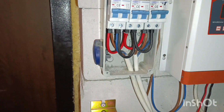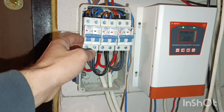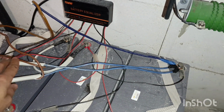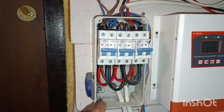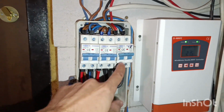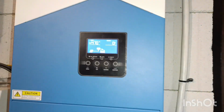I had to remodel this thing. This all now works for a 48 volt system. I replaced the cables. I made them two in parallel, because previously it was only one. So right now I have 20 square millimeters, and they are decisive for everything else. So this one goes for taking out everything, and it drags to these two inverters. So I hope that I will be able to increase the current out of it.